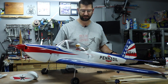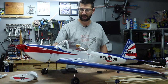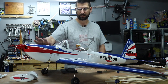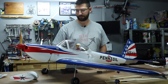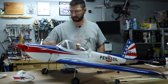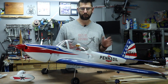Pretty much everything is done on the aircraft right now in regards to painting, finals, and decals. I've already done a wet sand on the color — the color is now ready for a clear coat to add that final sheen. To apply the clear coat, we're going to take everything apart: the cowl, the tail cone, the wing, the canopy, and we'll make sure the wheel pants are mounted and ready to go. We'll clear coat those as well and then take it into a paint booth.